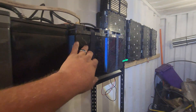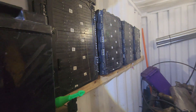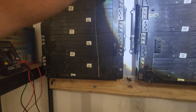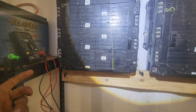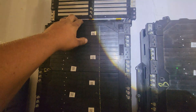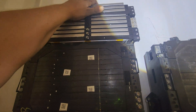You've seen a little bit of my stuff going on in my solar container and collections of lithiums and 12 volt stuff. It's been a while but it's time for these LG Chem cells to be put to good use. This front cage that holds the cell cover on will come off so we can get access to terminals, and we only have one terminal on the back side that we've got to get to. These are 10s 180 amp hour LG Chem pouch cells, so to make a 48 volt brick we need to add three more in series.